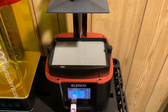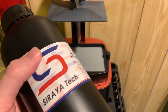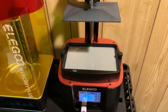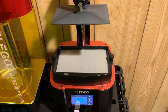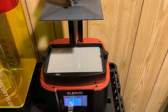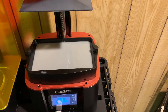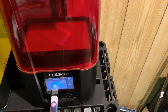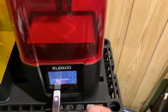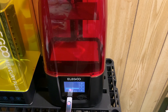Things are all prepared here. I've got the printer filled with fresh resin — I'm using this Siraya Tech stuff. The settings I have are 25 seconds for each of the base layers and then two seconds for each of the regular layers. I'll put the cover on, start that up, and that should take about an hour and a half to finish.